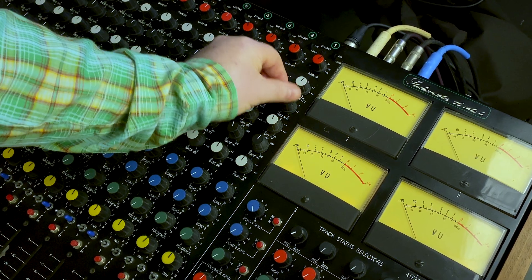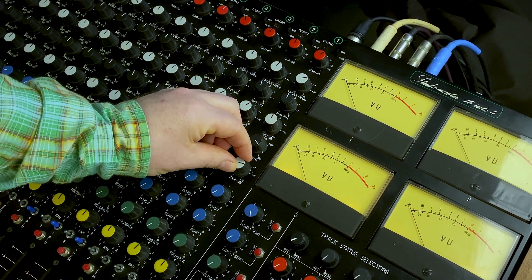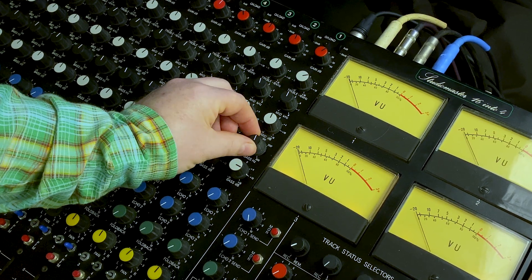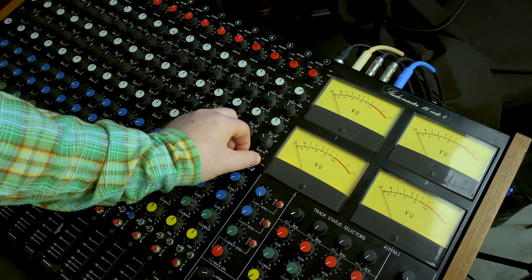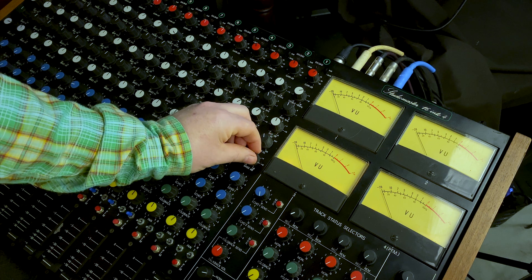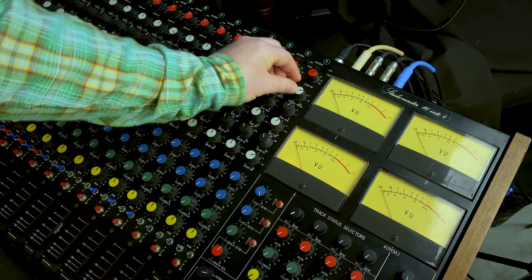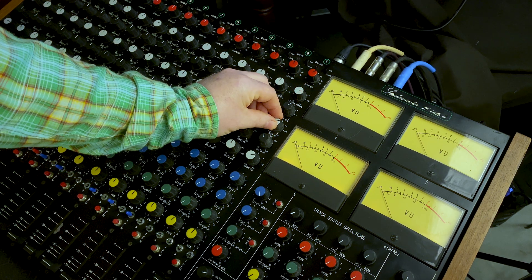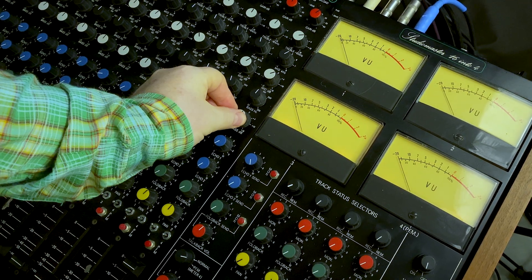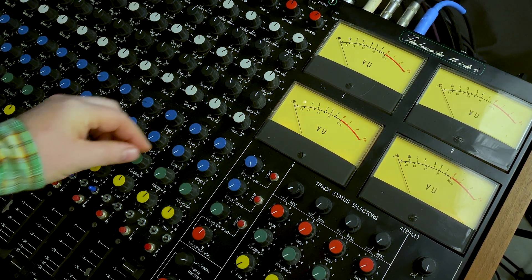Flattening that again, maybe just adding a touch of air. On the bottom end: 300 Hz, 200, 100 — getting quite thick. We can go down to 40 Hz — flat to full low-end boost. Very warm. If I was working on a snare drum I might push some top end, some 4k bite, and maybe 100 Hz there. A very manageable and sweet-sounding EQ section.